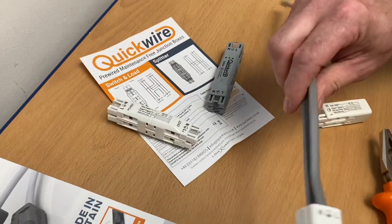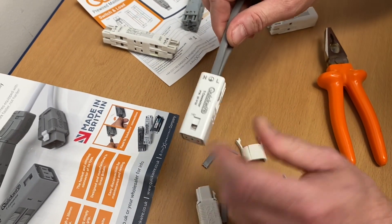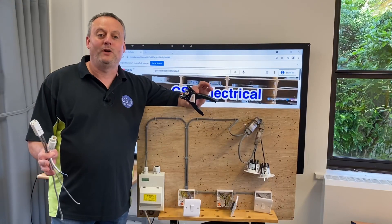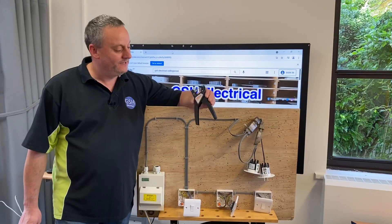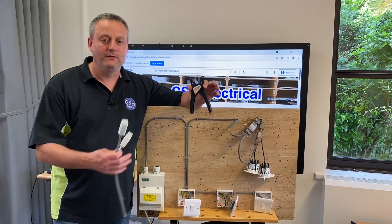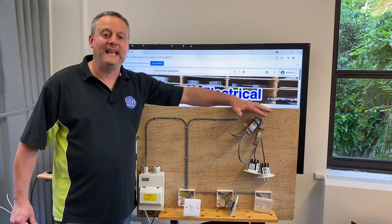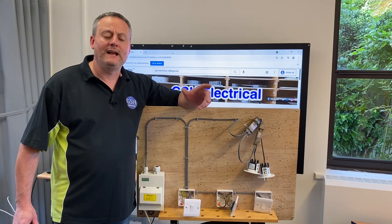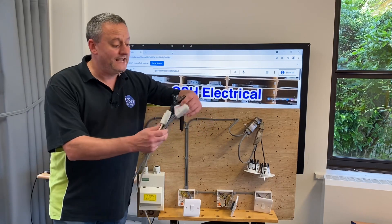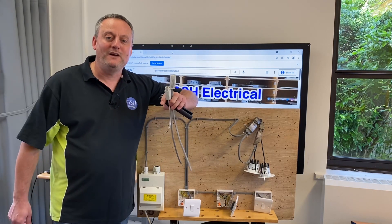I just thought I'd show you those because I've already done the easy fit connector from Collingwood, and this is the T connector from Quickwire - very similar process. I just love using those wire strippers and how the cable connects in there. I think that's a cracking bit of kit. I don't know which I'm more impressed with - the T connector, which is fantastic and easy to do, or the flat twin and CPC wire strippers. They do 1mm, 1.5mm, and 2.5mm - get yourself a set, both are fantastic together. I could have replaced the easy fit connectors with this one but I haven't, because this rig is going to be re-modified again - I'm going to look at safe isolation for AM2, AM2S and AM2E, and another video covering two-way and intermediate switching. But today was all about the Quickwire T connector and the wire strippers I've slightly fallen in love with. I hope this video has been some help.